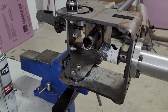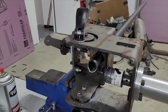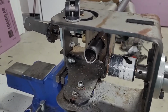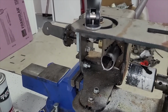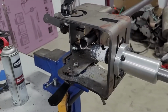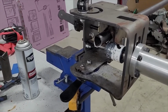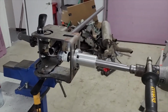So what we did, we used our CAD software and we would go through step after step of creating a profile wrapped around a tube, print it out, and try to get it to scale correctly, and then wrap it around the tube. If you finally did all that, you cut the shape out with scissors. I don't know if this makes sense, but it's basically like creating a sticker that you can wrap around the tube, and it has the right shape, and you can transfer that shape with a Sharpie. That did work, but it was so time consuming. You could literally spend an hour to do a tube, sometimes 2 hours, because it took so long to create the patterns and make sure they wrapped around the tube correctly and everything fit and scaled. Because you'd go to print it and it would be 5 or 10% off, and that would be a problem. So anyway, point is, you can buy cheaper ones.